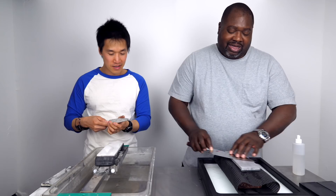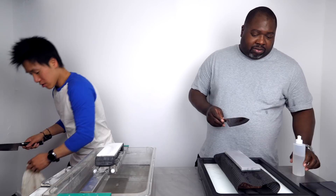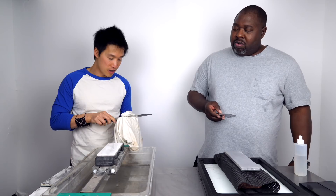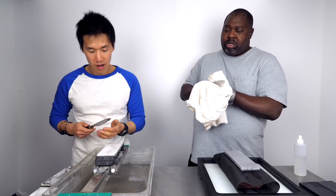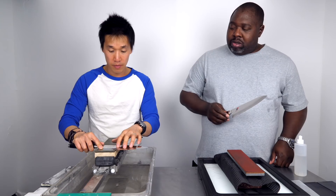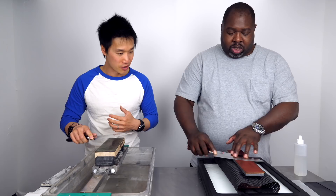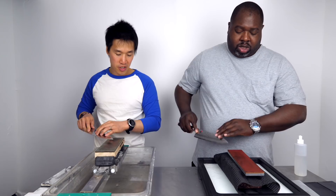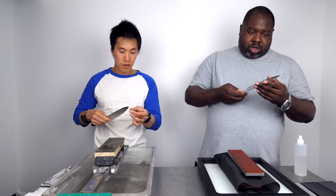So now we're gonna dry the knives off, then I'll show you stropping — it's gonna be a little different than the whetstones. You might actually like it better. Stropping has a much lower learning curve, and it reminds me of old barbershops where they always had a leather strap. So what we're gonna do is go from heel to tip, and go backwards only — always edge trailing, never edge leading on a strop. If your tip digs in once in a while it's not a big deal. Do that maybe 10 times on each side.